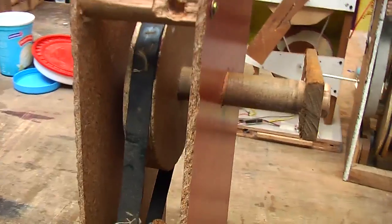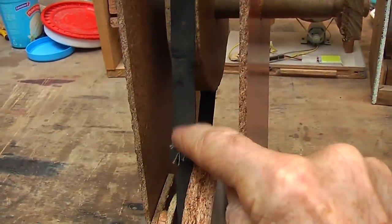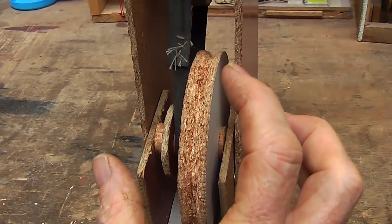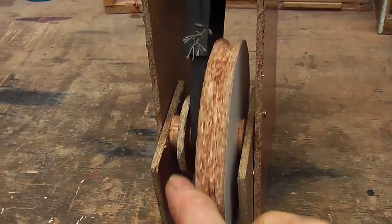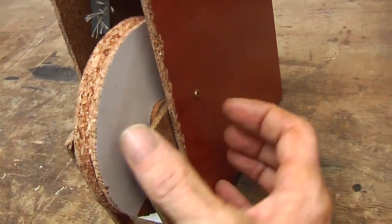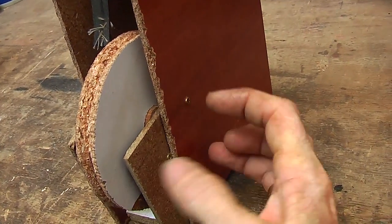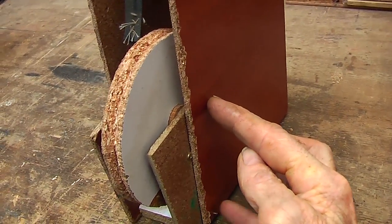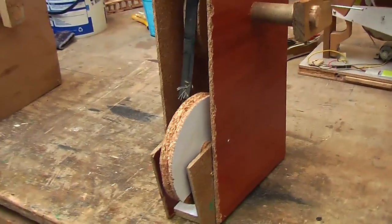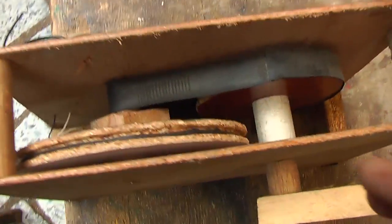In the next one I tried to improve the tensioning of this belt here. It is still sewn and looks a little ugly, but I thought I would be able to tension it by making this wheel with its motor on a separate unit inserted into the box with a pivot point — pivot it to tension it, and then fix it with a screw here. Yes, it worked, but it wasn't particularly pretty, so I thought I would simplify it a little bit better.